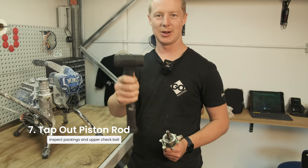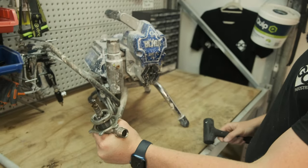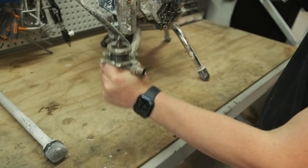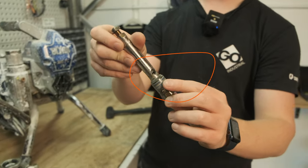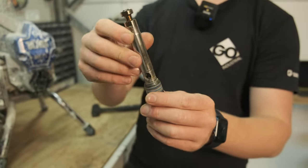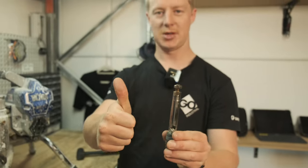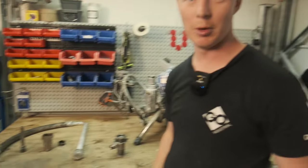Your next step: use a rubber mallet so you don't damage the top of the pin. Hold it so you don't hurt your hand and just hit the top of that piston. First thing we're looking for is: are the packings all in the right order and are they warped? They're not warped, so that's okay. Next thing we're looking for is whether there's something obstructing the little ball — if you shake it up and down and you can hear it move, it's good. Once you've checked all of that, hold it to the side and we'll move on to the next spot.